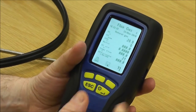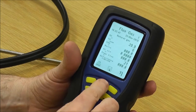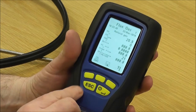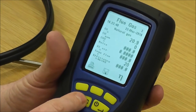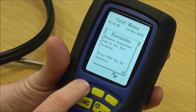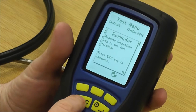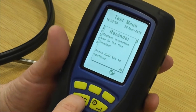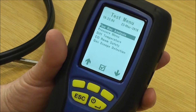That's how you set up your flue gas analysis. Simply put that in the flue — normally within about a minute you've got all your readings, they stabilise out, you save them and then you can print them. If I press escape it gets me back one. It's saying to me: replace inspection cap in the flue terminal — that's just a safety function to make sure you've replaced the inspection cap. Press escape and it gets us back to the test menu.